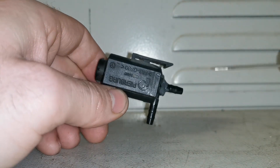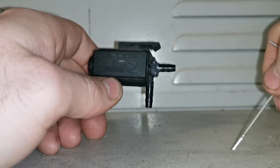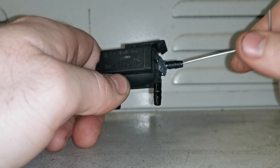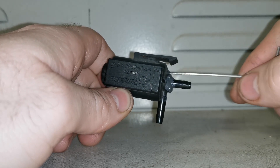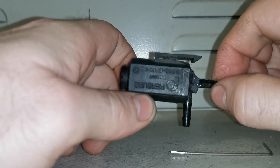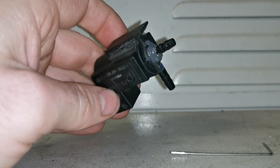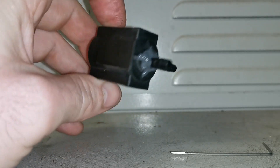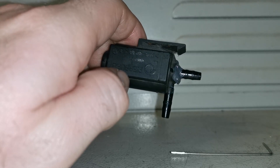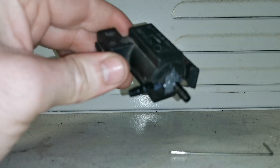Now that it's removed from the clamp, there are only two things I'm concerned about: has it secured properly, and is there any issue with the inner or outer surface? I'm looking for any pin holes that could allow pressure to escape, and checking that the hole is still free. Movement in and out shows me it's pushing down past the JB Weld fine. The JB Weld stayed on the outside, there are no pin holes, it's very secure, and there's no reason why this isn't going to be a success.